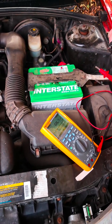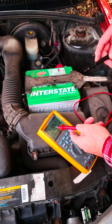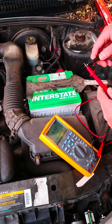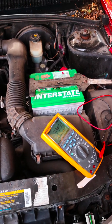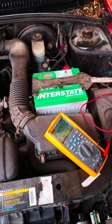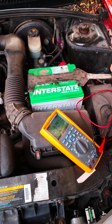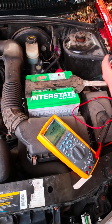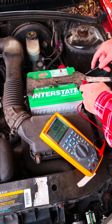So it's now in a continuity test. Okay. Out of limits, not overloaded. Out of limits. You touch together, I have a reading. This is usually, it'll say in the manual of your meter, usually it's like 34 ohms resistance. If it's under that, it'll beep and tell you it has continuity. This is handy if your head's stuck in a piece of machinery and you're trying to reach the contacts but can't see your meter, you can be going around going, do I have...